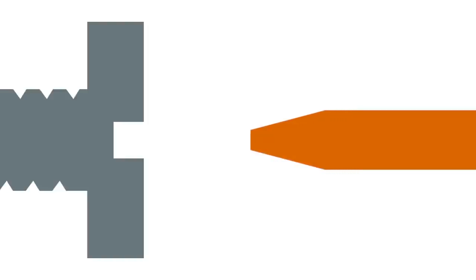Let me show you what I mean. Here is a side-on sectioned view of a metal screw, slotted, like we'd see on a firearm. And here is a common hardware store screwdriver. Note the taper, the wedge shape — one that means we make contact at the top of the screw, so any resistance will put force at the least reinforced surface, leading to distortion of the screw head.